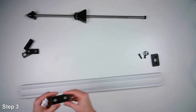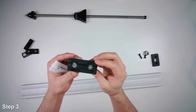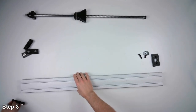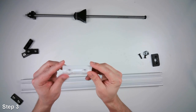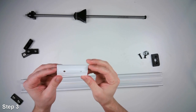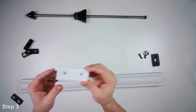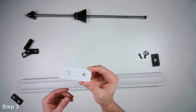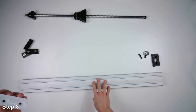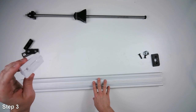All right, we're going to be attaching these bearing pads. So these are the ones from 8020. These are the UHMW ones that you can get. And these are made specifically for the 8mm slots. In the plans, there's also this 3D printable version that you can make out of the igus iglide, or igus, maybe it's pronounced that way. And then there's also a version of this for the 10 millimeter slots. So if you do have the 10 millimeter slot extrusions, you'll want to print out the bearing pad out of the igus material.